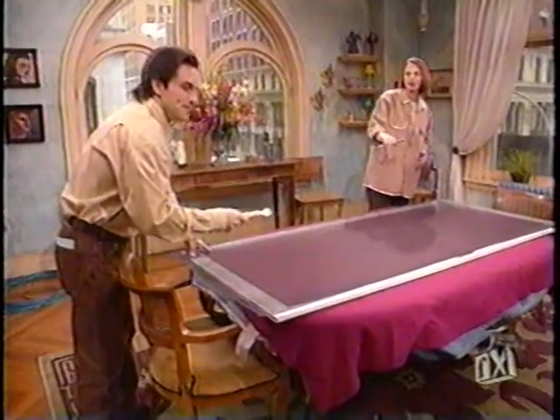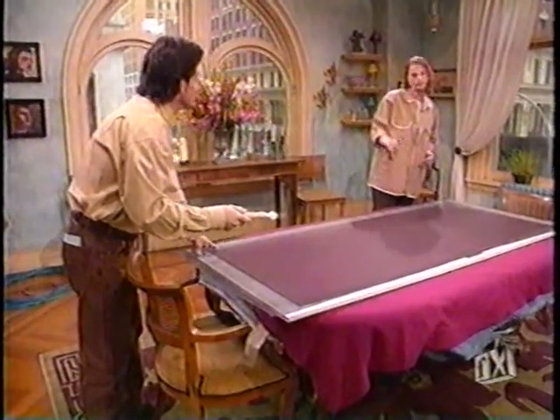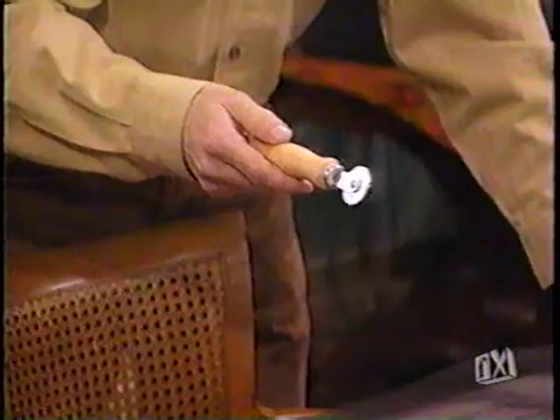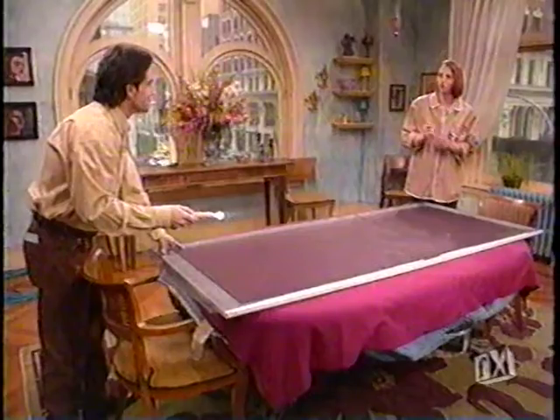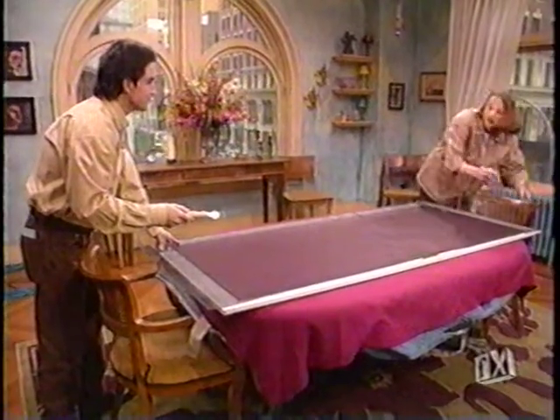That's a spline — actually a tool specifically for screening. Is it a necessary tool? You can use one; it does put the molding nicely into the groove. However, I start it out with a screwdriver because I tuck it in, then use the spline to get it into the groove nicely. So you don't have to go out and buy one — you can use a screwdriver, but it's all up to you.